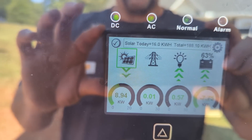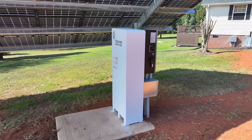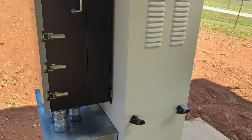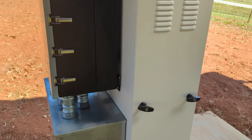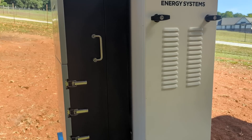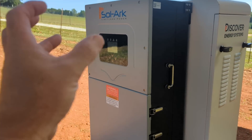It's a wrap — we're charging this battery nicely, jumping around eight kilowatts into it. It was at 20 percent and we're discharging it to 20 percent every day. We have this thing programmed to deal with the time-of-use settings and peak charges coming for this utility in two weeks, where they're going to charge $13 per highest kilowatt demand in a month. Use 10kW and that'd be a $130 charge added to your bill — and it's between the hours of three and six, so you're not going to turn your air conditioning off during that time.